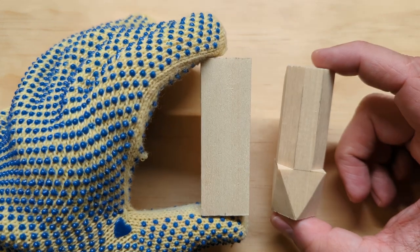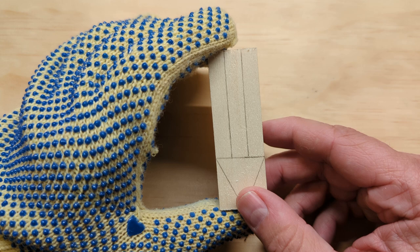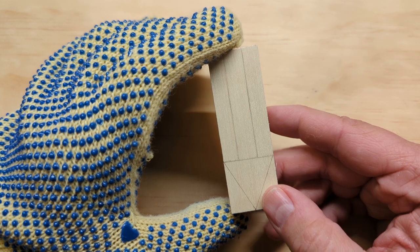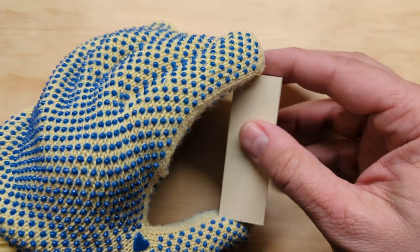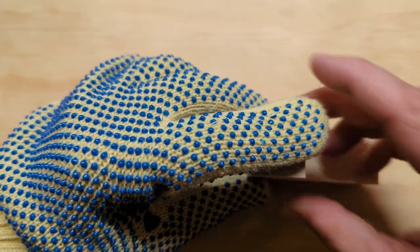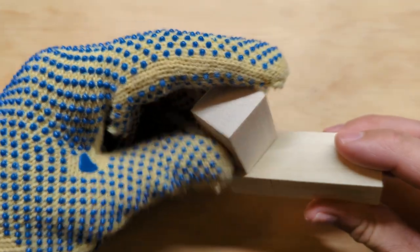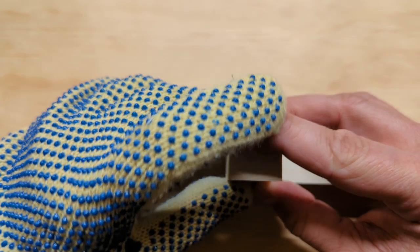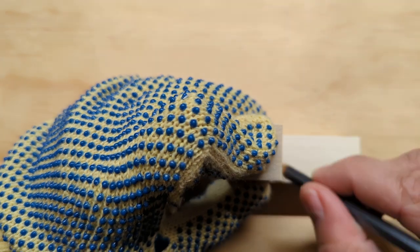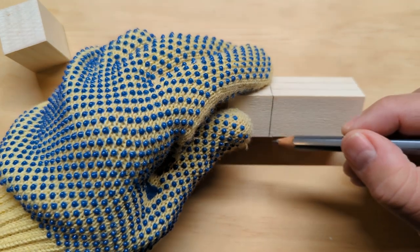We're going to start with a one by one by three inch block. I've already started to mark this — I'll show you how I did that. First thing is to mark one inch up from the bottom of the carving all the way around. A little tip: if you've got another one by one inch block, you can use that as your measuring guide, set it there, and draw your line. I've already marked that one inch up across all the other sides.